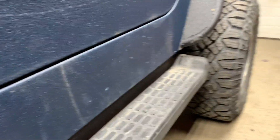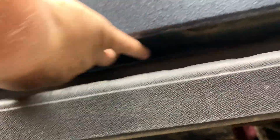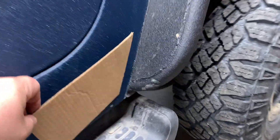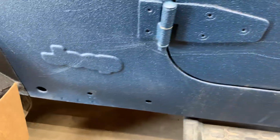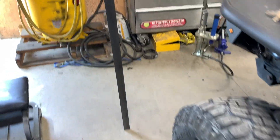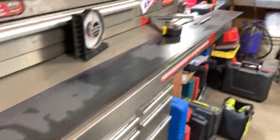Now it's time to come up with something with the sliders. I got the plate that's going to go on here. Then I think I'm going to weld a piece of flat iron on the bottom because the body has these tabs that go along, and then I can just bolt to the bottom of there too. That'll bridge it up real good. This is just going to fit up perfect once I cut my angle in there. I use my little template here — it's going to fit up like that, come across, come straight. And that actually fits up perfectly. I got a piece of flat bar right there and then I'm going to weld across the bottom like a 90.